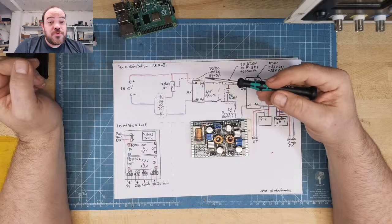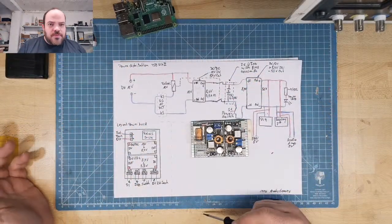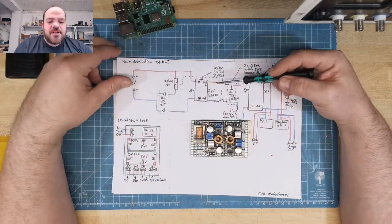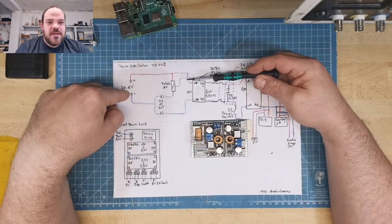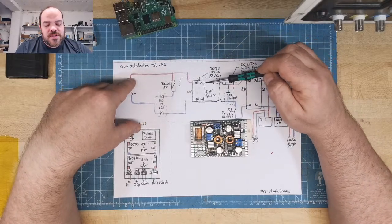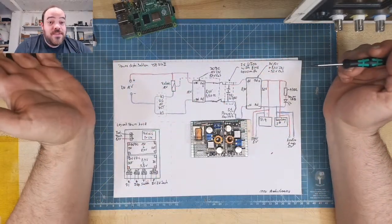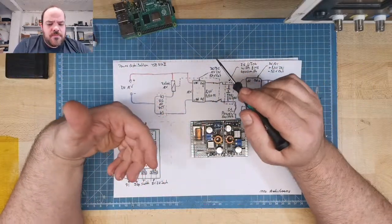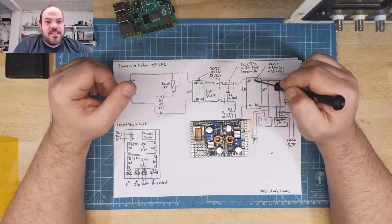One of the problems when I was testing it, I hooked up four multimeters to test input voltage, output current, charging current, and such things. I figured out that even when I unplug the power supply, the battery just feeds back. The voltage goes back into the module, and it takes about 50 milliamp, so the battery will drain without any reason. Of course, I could just add a switch to switch between charging and using, but it should be easy for another person to use it, not just for a geek like me.